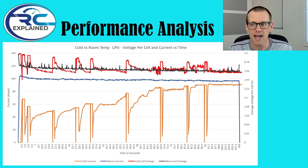The voltage axis goes up to 4.2 volts, and most of our data is around 2.94 volts and up. Starting at 4.2 volts, as soon as I punch it to full load — about 105 amps on a healthy battery pack — the voltage dumps all the way down to under 2.94 volts, hitting the cutoff which saves the battery pack. It then jumps back up, we hit it again, pull more current, and it hits the cutoff again. Every flat line on the top section of the red cold battery curve represents the battery resting before being reloaded to see what performance we can extract.